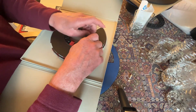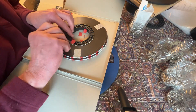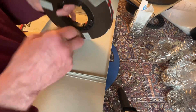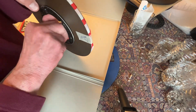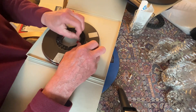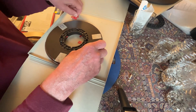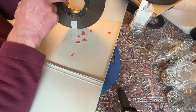They used this tape to hold everything together over the years — it doesn't really do its job that well after being shipped and everything. The purpose here is to get the two pancakes disconnected from each other by removing all of this tape, and carefully not allowing the tape to jump off the NAB hub. Because if it does jump off the NAB hub, you're going to have tape salad, and tape salad is nothing good whatsoever. Once the tape jumps off the NAB hub you cannot get it back on — at least I've never been able to, and I have had a couple of disasters.